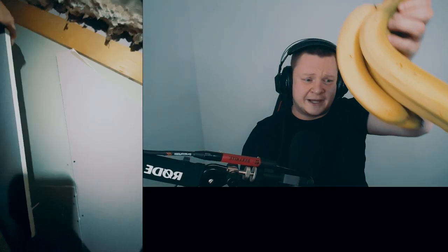Check out the finish to this party wall inside this loft — absolutely ridiculous. They've boarded it out of five billion different pieces, none of it properly. They need to pull all that plasterboard off, stop messing around, and plasterboard it properly — make sure it's fire safe. What sort of finish is this? It's like you've got a child plasterboarding the wall. How is that fire safe? Shocking.